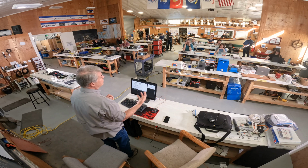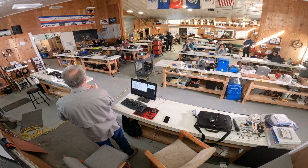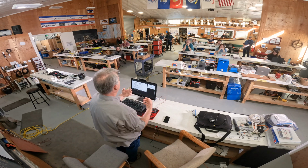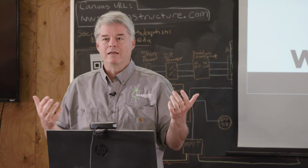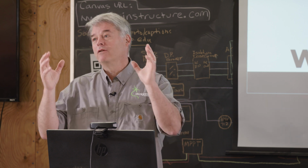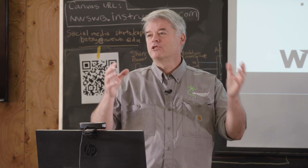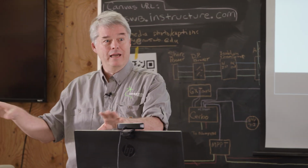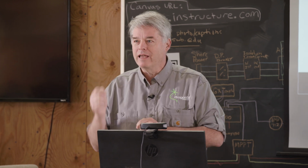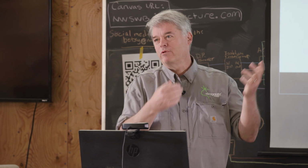But that's opening up other aspects. We're finding barbecues, we're finding hobs, we're finding in-floor heating. When I fitted out my personal vessel, I tried to remove propane. Just because, one less fuel system to worry about and have to refill the tanks. I worked my hardest. I found we solved the problem for heating. We didn't care about air conditioning up here. There was a solution for the hob. You could get one. What was the stumbling block for me is, try as I might, I could never find a diesel-fired barbecue. So I had to bite the bullet and leave propane on the vessel.